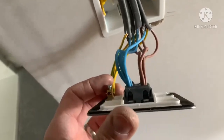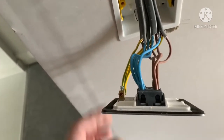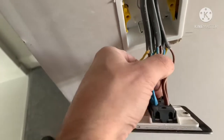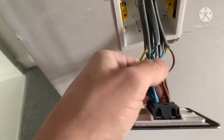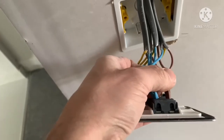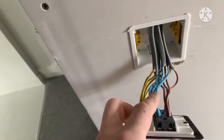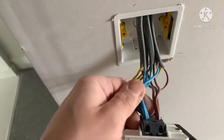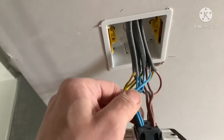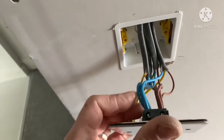So many lighting manufacturers nowadays have come out with fittings that can only really accommodate one cable. If you've got a loop up at the fitting, you've got to doctor it and it's harder trying to get all the cables squeezed in because they're designed by morons. So I take my mains down to the switch for the neutral, and then you've only got one cable up at the light - it's easy to make off. In this case with commercial downlights it doesn't really matter, but with a centre light it's just much simpler having one cable up there.